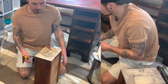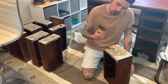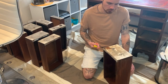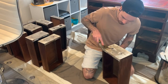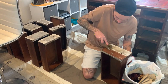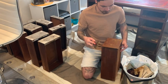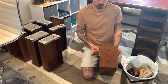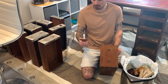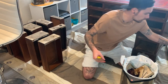The stripper has been on for about 40 minutes so we're going to strip it now with a scraper, then use some steel wool and sandpaper to see what it looks like afterwards. I'm going to put it on the floor to make it easier. Once I've done all of them I'll clean them all with some soapy water and maybe some sugar soap, and give them a rub down.